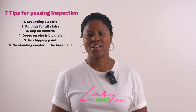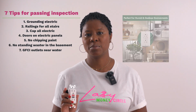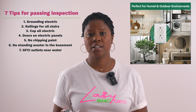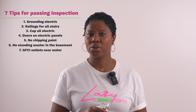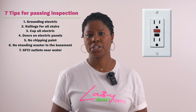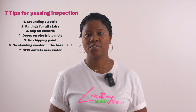Tip number 7, GFCIs in all places in your house that have water, whether it's the basement washroom near the washer and dryer, the kitchen, the bathroom, the powder room, every single area that has electricity and water nearby, you have to have a GFCI. So ask your electrician for that. The rule is, if the electric outlet is less than 6 feet away from the water source, then you have to have a GFCI.